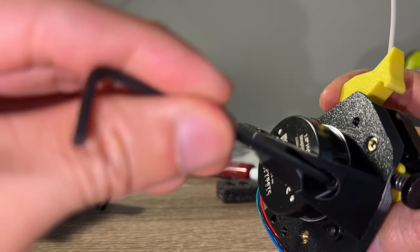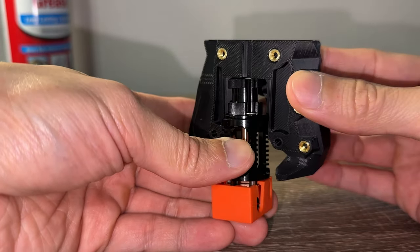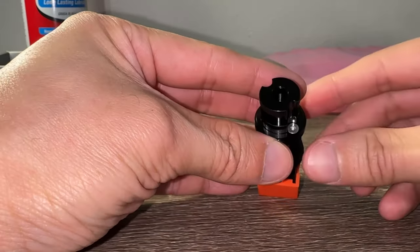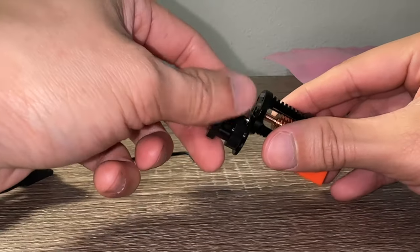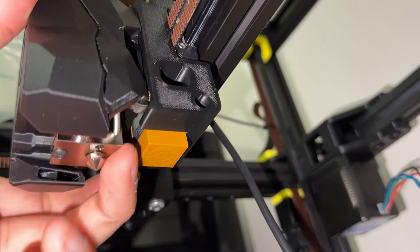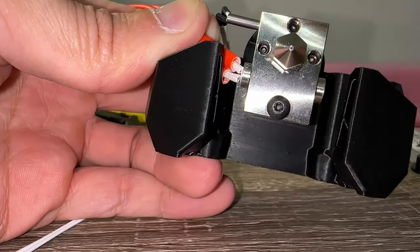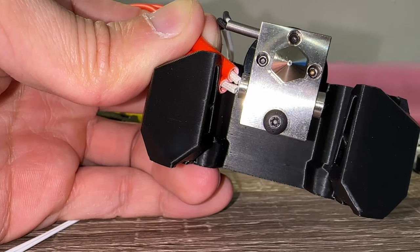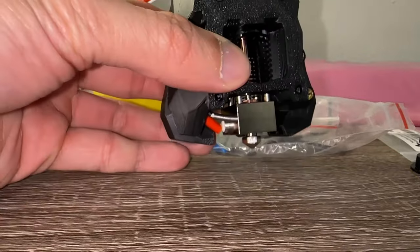The remaining steps for the cable bridge and cable mounting are straightforward and omitted from this video. For the tool cartridge, I was puzzled regarding how to mount the Dragon hotend — I finally figured out you have to remove the top piece, secured by two screws that strip extremely easily. I lucked out because one screw was already out before the other one stripped. This heat block can be installed in two directions; I line it up to allow more space between the inductive probe. Be careful not to bend these wires too much. The nozzle, thermistor, and heater cartridge may loosen at operating temperature. One option is to re-tighten these when hot; another is to torque them while cold using thread locker. A loose heater cartridge has caused fires, so take this seriously.